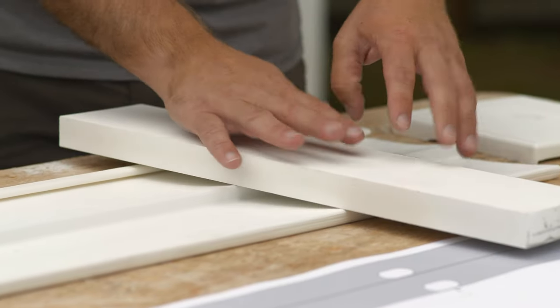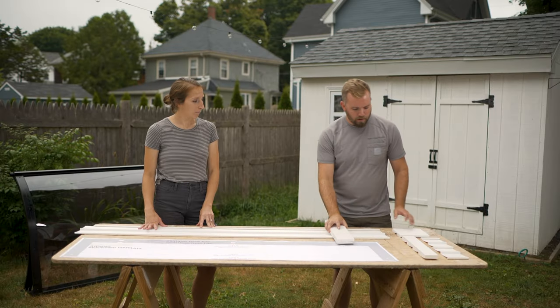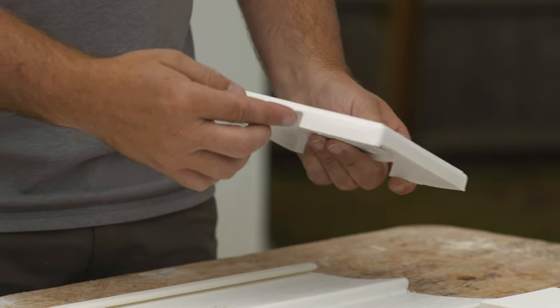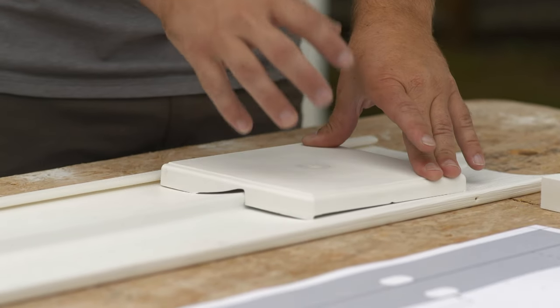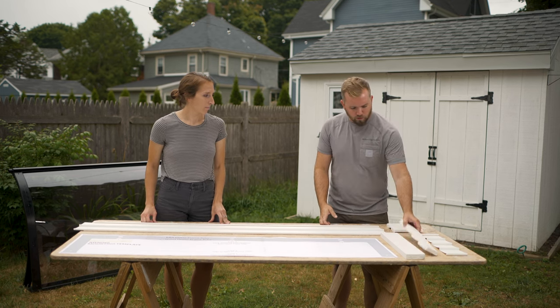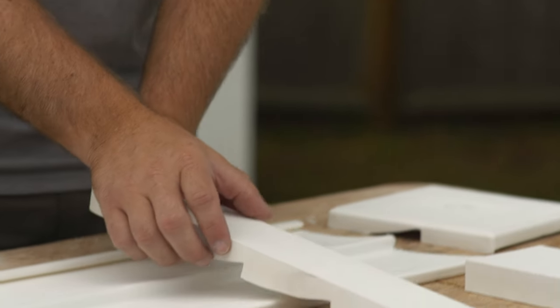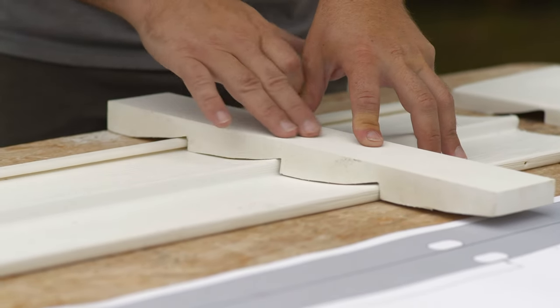This manufacturer actually sends a template to take a lot of the guesswork out. But first off, we have to address that you have vinyl siding on the home, which is not a flat surface, and we need to address that issue. If we just bolted it right to the house, you're going to have all these gaps here, and we're also going to compress that vinyl, which we don't want to do. They sell these lighting blocks that have that double four profile cut out the rear, and that creates a nice flat surface for us to mount to, but this is not big enough or long enough. So what I'm going to do is actually create my own block. I took this five-quarter PVC and I cut this vinyl profile out the back of it. You can see that's nice and flat and we can mount the awning directly to this.